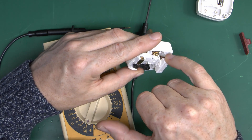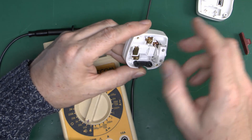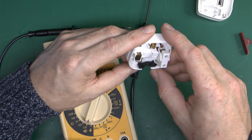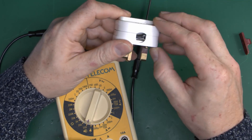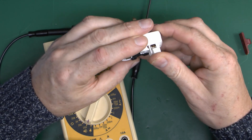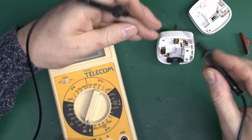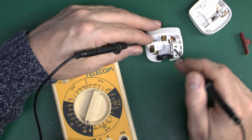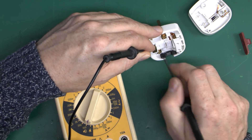So we just scrape a bit of that blackness off to reveal the stuff underneath — it won't take a lot between those two contacts to prevent them from working. With that aquarium pump — basically a little transformer and a set of bellows — it's a fairly inductive load, so some arcing was almost inevitable. It's very likely one of these things that's gone intermittent, because sometimes it'll make a connection through and other times it won't. Also, if you get a bit of dirt stuck in there, that's going to prevent it working too, because this is completely open — there's no real protection against dust, and even with the lid on you've got a big hole where the flex goes in. So although it shows basic continuity at this very low voltage, that isn't particularly conclusive. The blackening on those terminals would suggest it's been arcing quite a bit.